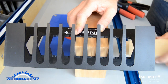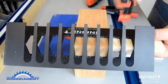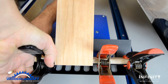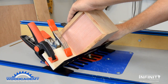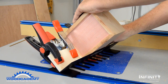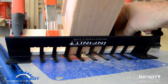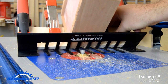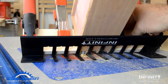The boxes were designed to take advantage of the one-inch dovetail spacing built into this model of the jig, allowing a pair of stop blocks to be clamped to the jig to locate the box through the four corners that need to be milled. Cutting the dovetails is simple — the jig slides across the router table, controlled by the included guide bushing, which cuts all the dovetails at a very slight taper to match the splines.